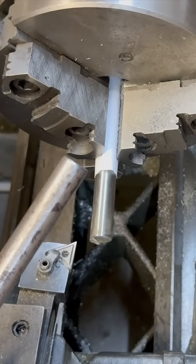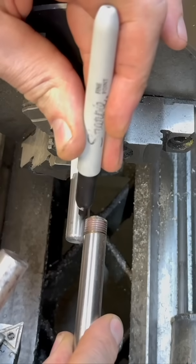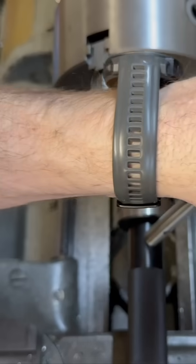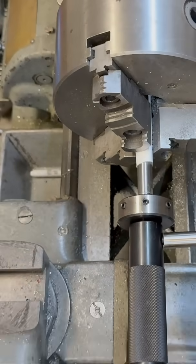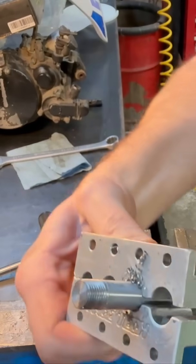I'm just going to clean up that end. Now I'm going to put a little bit of a bevel on this to mark where the end goes. Slide on my die — got my die started. Be careful, keep on tapping. Very nice — one end done.